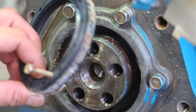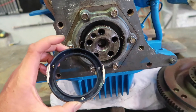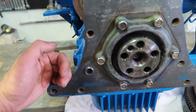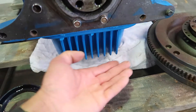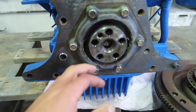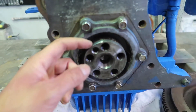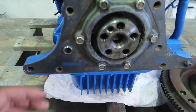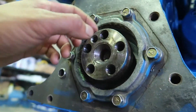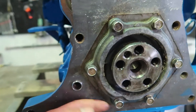So the main reason I pulled the main seal off is I was a bit worried that there was corrosion on the flywheel — as if some water got in somehow and was sitting in the bottom section of the flywheel. I was worried that water went in there and then most likely into the sump. I noticed some corrosion around the front end of the shaft, but it looks good because inside there where this seal ends, there's no corrosion. It's just smooth machined shaft, which means very likely no water got inside the engine apart from onto the flywheel.